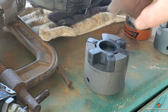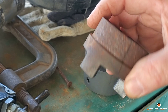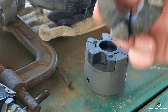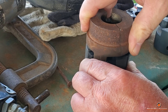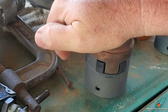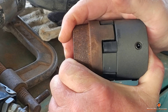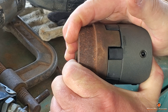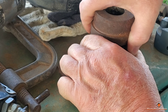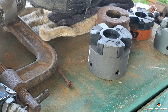This is the piece that originally broke the first time around. It is the same size as the upper coupling except for the ID, and it fits right in here just like that with absolutely no backlash. It keeps constant pressure once it's pushed together — it's got good contact on both sides of that spider, so it won't be twisting and getting gnarled up in there.